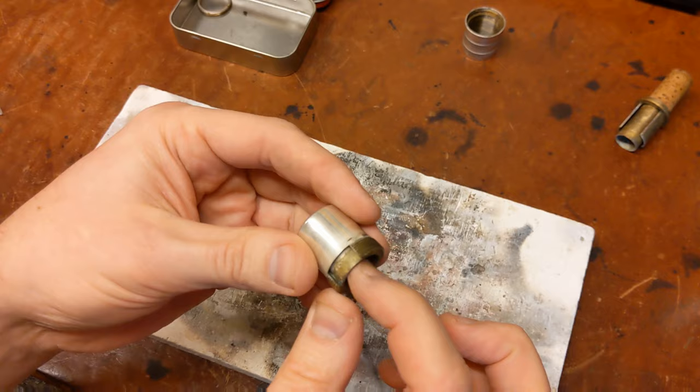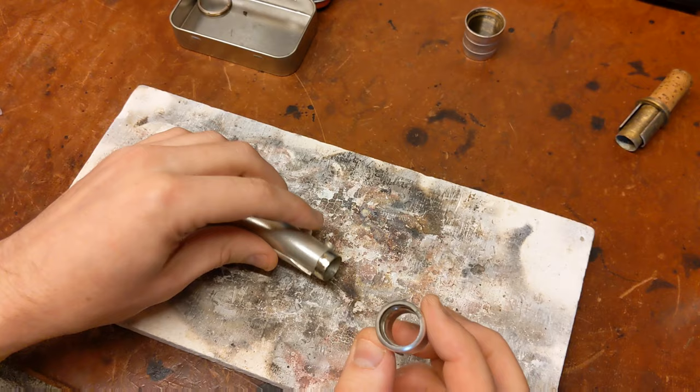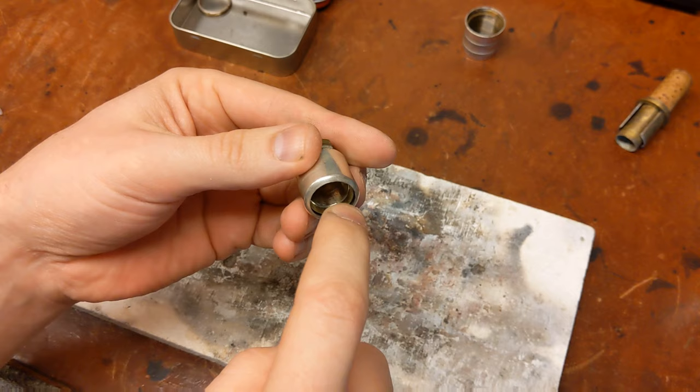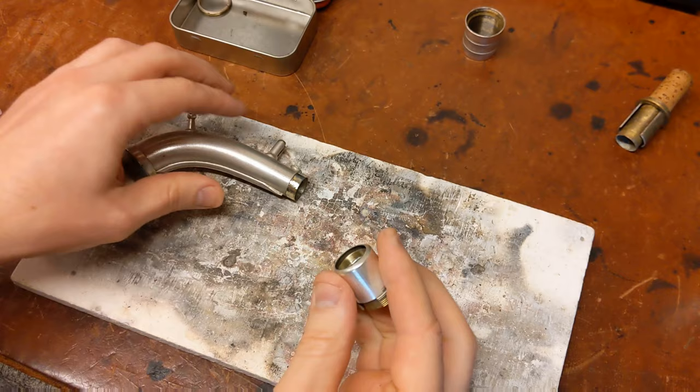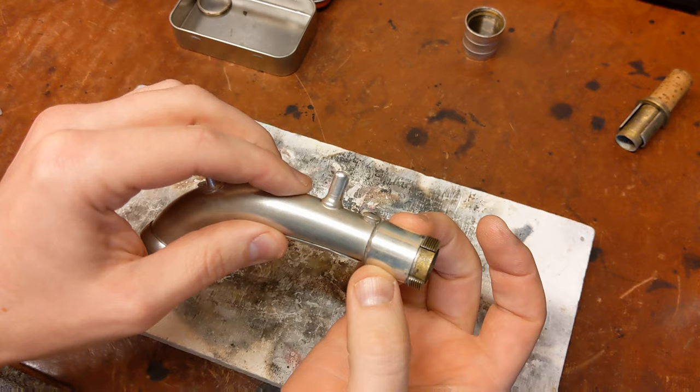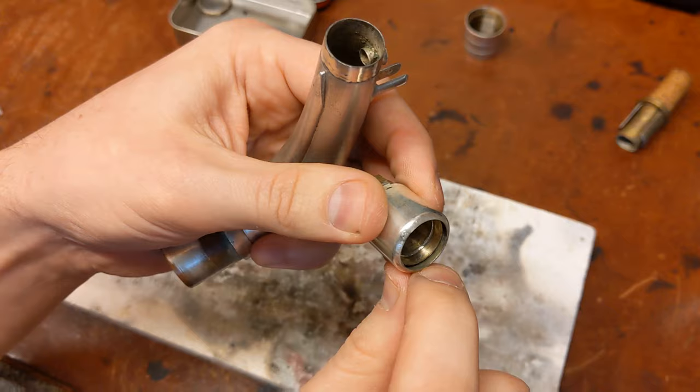So if you have to solder this back together, what you need to do is clean up this — clean up the inside here, you see that mating surface there? There's a lot of mass there, so we're going to flow some solder onto this receiving end and then put it on, heat this part, press, and it should pop into place just as the solder melts. It'll already be adhered to the part that has the most mass. If we do it the other way — put solder on here and try to flow it — it's just going to go into the gap and not actually flow into the mating surface.